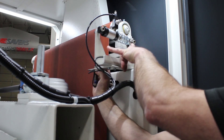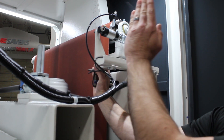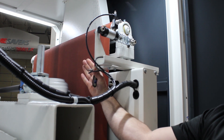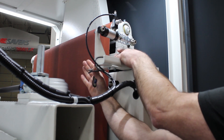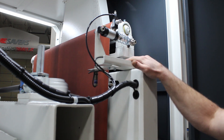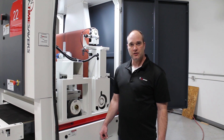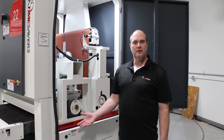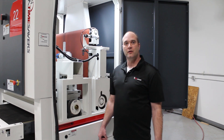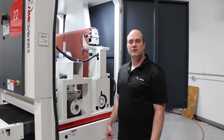When the beam is blocked, it's energized — the solenoid valve has opened up and is creating action in the tracking cylinder, which steers the abrasive belt away from the photoeyes. Then once the beam can see itself again, it will put the idler roll in its normal position and the belt will start walking back towards the photoeyes. Whenever diagnosing and troubleshooting a piece of equipment, it's always good to refer back to the sequence of operation — that gives you a step-by-step procedure and things to check to find out what has failed on the system.